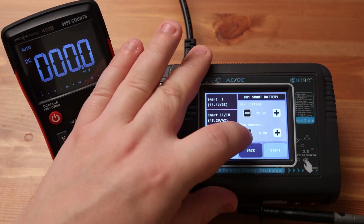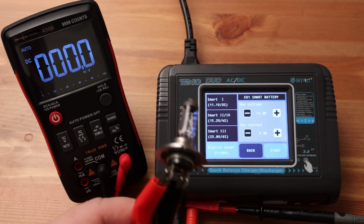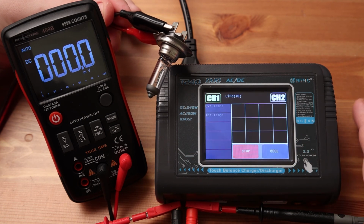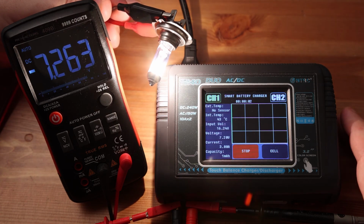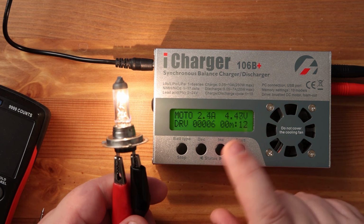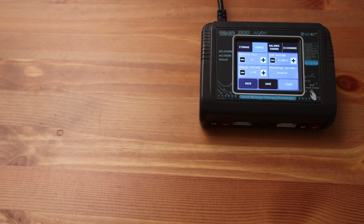Some devices have the function of a laboratory power supply. It is very comfortable. For example, as in the T400 model. Just imagine, this small case houses two fully independent lab power supplies. You can set any voltage and any current. You can supply power to the car radio on your desk. Or here's another example. I needed to cut a large piece of styrofoam. I took a nichrome wire and connected it to this charger. When applying high voltage and powerful current, the wire gets very hot and cuts styrofoam perfectly.